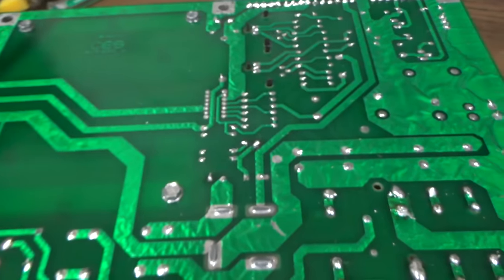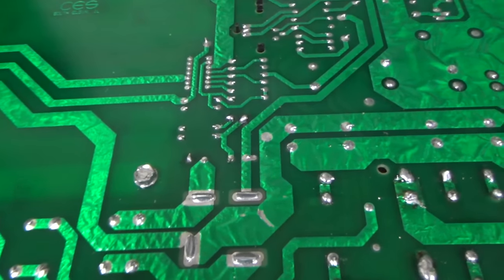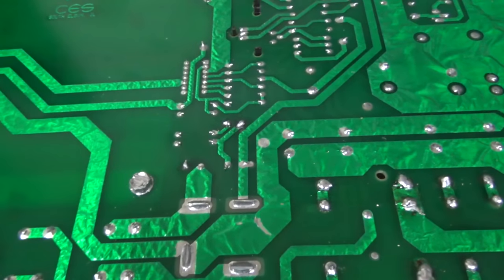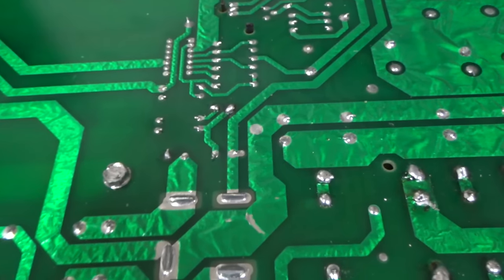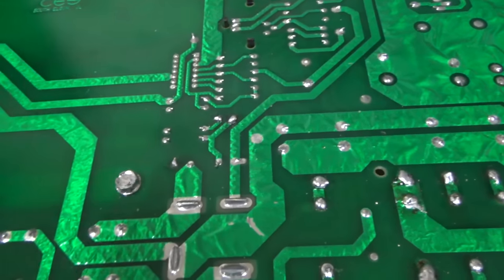So that's a hissing sound. What would be hissing? It's leaking capacitors. That's what's hissing. So these things start leaking, and it causes all kinds of problems. And then whenever you... I can smell it right now. There's like a smell to that crap burning.